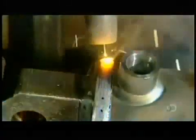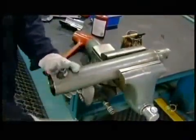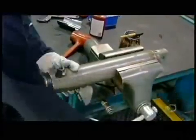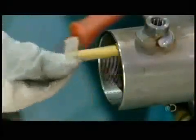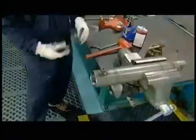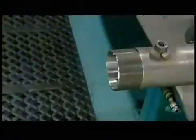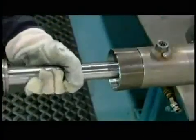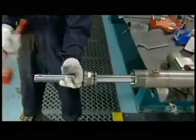Production now returns to the cylinder barrel as a robot welds a cap onto it. The open fitting adjacent to it was installed earlier to attach the hose that delivers the fluids. The worker clamps the cylinder barrel in a device to stabilize it, then lubricates the threaded open end so he can easily slide a metal sleeve into it. This sleeve prevents snags so those critical sealer rings remain intact as he now inserts the piston rod assembly into the barrel.